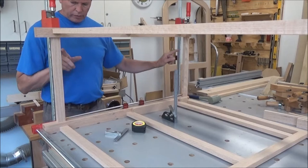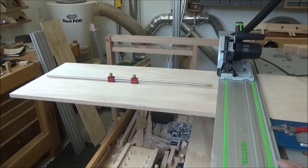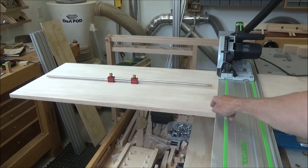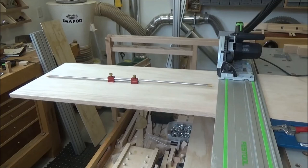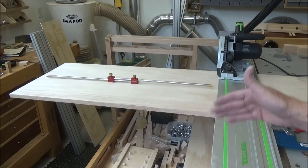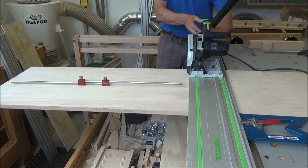I won't cut the tongues until I make my grooves here, so I can match the tongues to that groove. I've got this set up with my TSO guide rail square. I'm giving myself a generous cut — probably an extra inch — then I'll double check that it's square. I can then take these to my table saw and cross cut them using my fence to get the exact length and width I want. This is still probably about three-quarters of an inch too wide so I have to narrow it down, but so far it's looking pretty good.